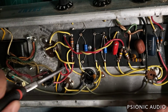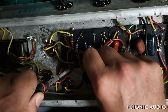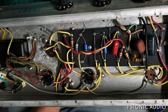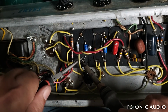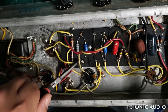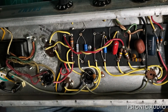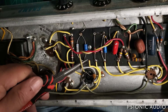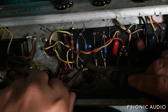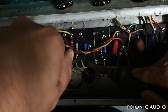My pliers go. Went from that 500 to the 680 because that's the next standard resistor value. It's not like I could choose a 573 or anything like that. Sometimes I've got to make a value that doesn't exist, or I've got to order a very strange value. But I think in this case, the 680 will do us really well for a good sounding, long-lasting Champ.